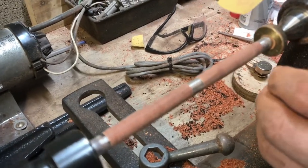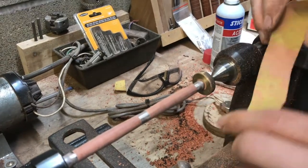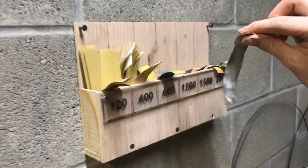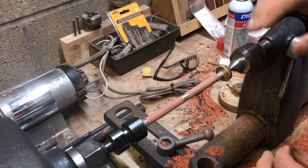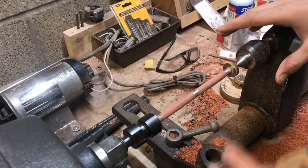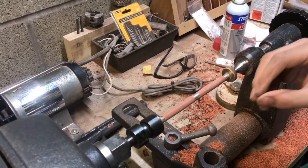It's really important at this point because sandpaper from 600 grit up really isn't going to remove much material. So at 400, I want these to be perfectly flush. Now I'm going to start from 600 up to 2000, which some people would say is too high of a grit on the wood. But I need the wood to be almost a perfect finish because when that CA glue high-gloss finish goes on, it's going to make any imperfections pop. So I want to make sure it's perfect.